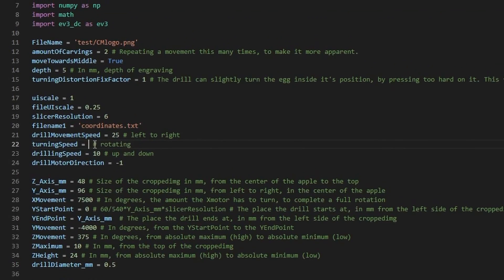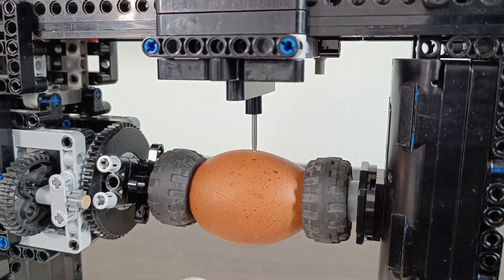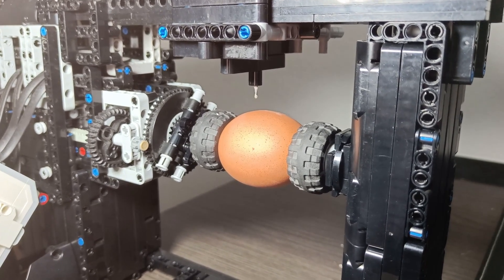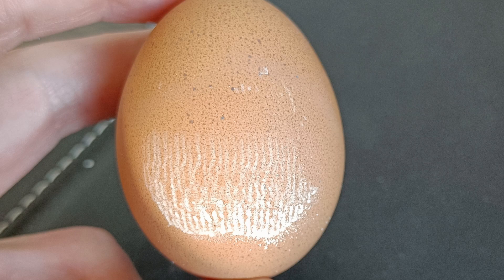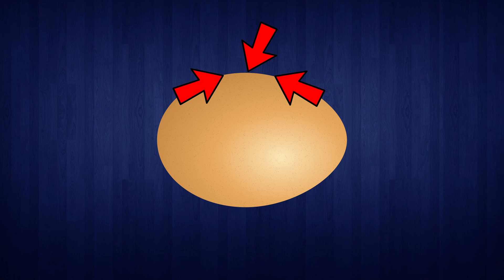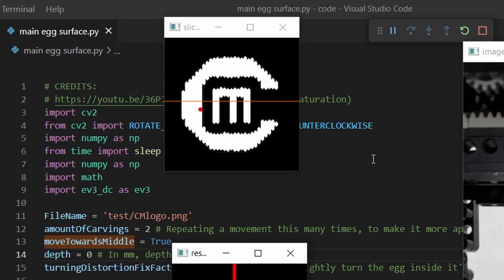Let's actually put some effort in. For the egg we need an even more precise positioning, so I reduced the speed a little more and set the depth of engraving to 0 millimeters so that it wouldn't go into the egg. Since engraving an egg is a little less visible, I coded an entire new slicer so that the machine would be able to engrave surfaces instead of outlines, and on top of that I made it so that the machine runs over every line twice to make it even more visible. If we were to run the code now we would see that it only engraves the bottom well while the top would be barely visible. This is because the egg is rounded and going downwards with the engraver doesn't work as well since it skips over the surface. That's why I made the machine find the highest point of the egg and always move towards that point, meaning the longer lines are now split up so that it always moves up the egg. It took me countless fails and about a month to edit this code to work with the egg before I got to this final code. But now let's grab ourselves a new egg and see if we can get this machine to engrave a nice logo.